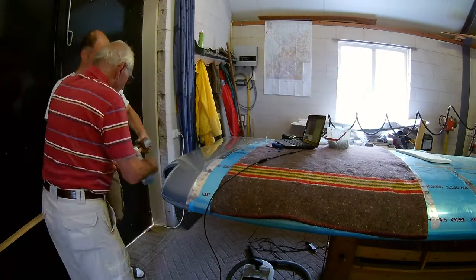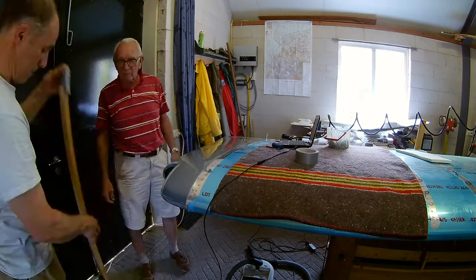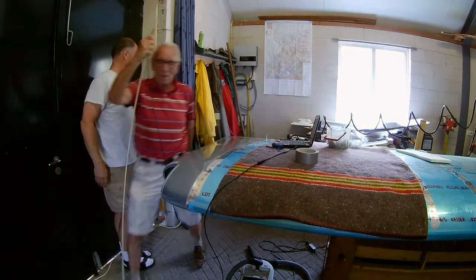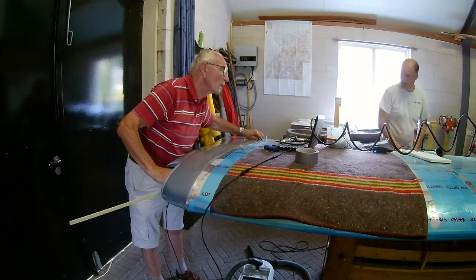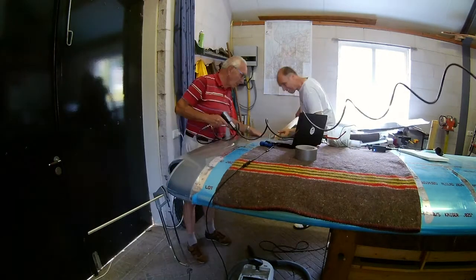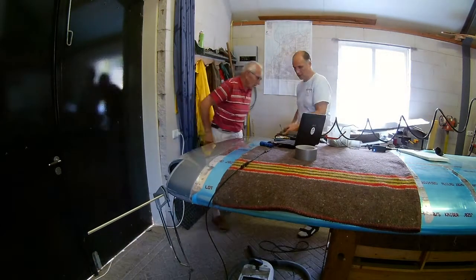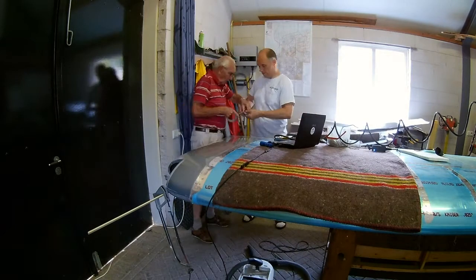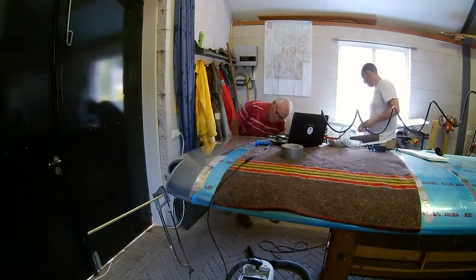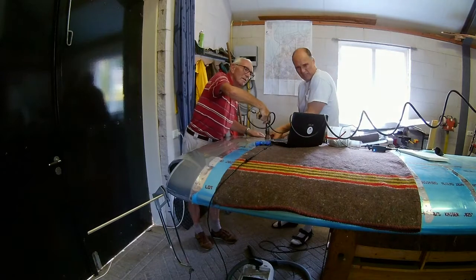And even that is too short, so you can see I made a stick — I put the hammer with duct tape on a stick. It turns out it is better to have the bucking bar in there and the hammer as a counterweight, so it is easier to buck. That is the technique we use. You can reach in there and that way you can buck the rivets. We could do all rivets with normal solid rivets; we didn't need any blind rivets.